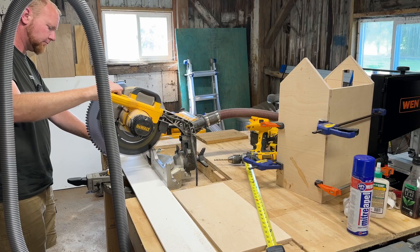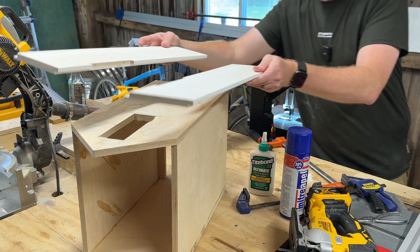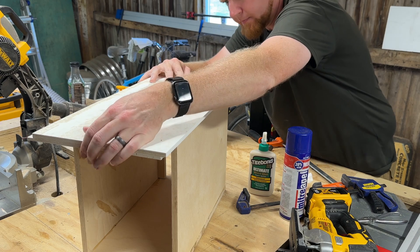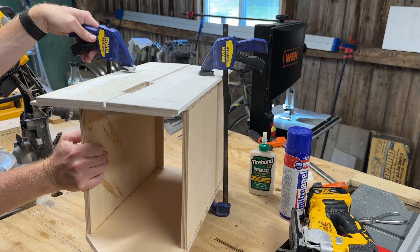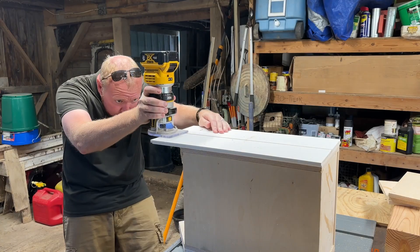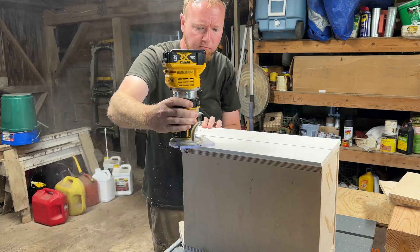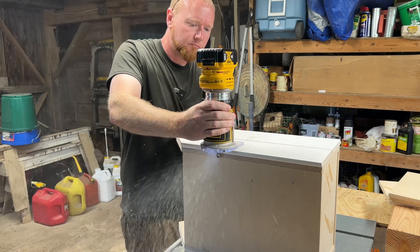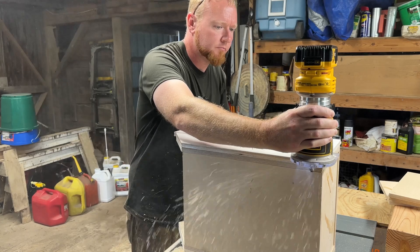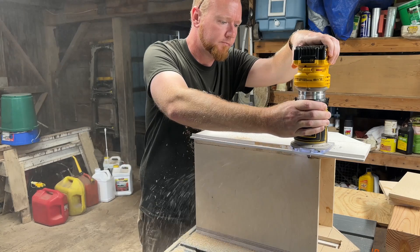Back to the build: I don't know if this is the most effective way to do this, but I was pretty happy with the outcome when it came to putting the shiplap on the outside of the box. Instead of pre-cutting and matching all dimensions, I put them on the carcass purposefully oversized, and after the glue was dry I used the palm router with a flush trim bit to make the shiplap exactly the same size as the plywood carcass. Wiser future me knows I probably shouldn't just plow through a solid piece of wood like that because it could break the bit — but past me had no idea and it worked out fine. Ignorance is bliss.